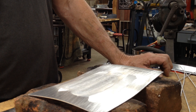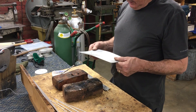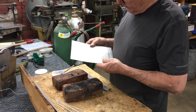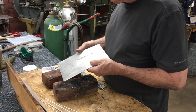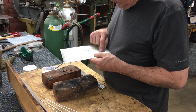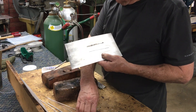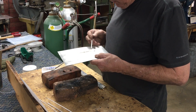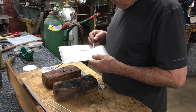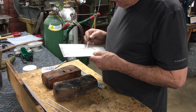Would you like to wash this one off and look at it? Yeah, let's wash this one off. Here's the piece that I just washed off — this being the front side from which I welded it. On the back side, you can see that the bead that I've protected with flux is very smooth and wet out into the metal. You can see there's no hard edge at all where the edge of the bead is. That's perfectly protected by the flux that was on the back. On this side, the dirt is apparent.